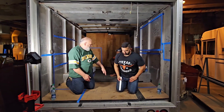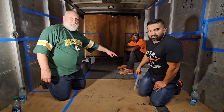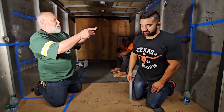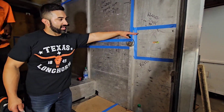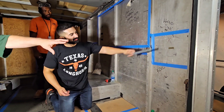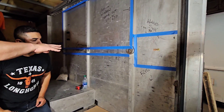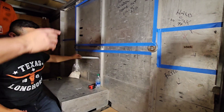This will be the walkway — about 41 inches in between the wheel wells. Over here, this area will be a hand sink, a hand-washing station, and then we'll plumb down below and over to our gray water tank. The bottom blue line will be the serving table and prep table.